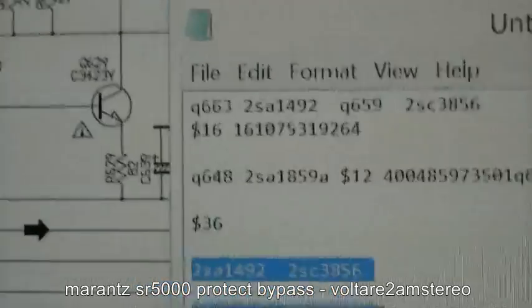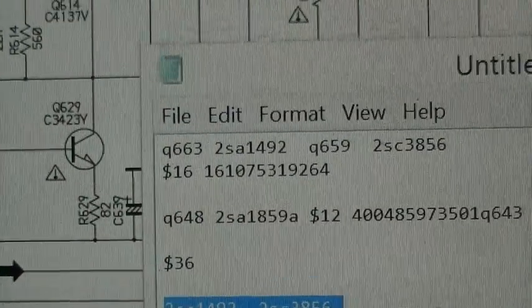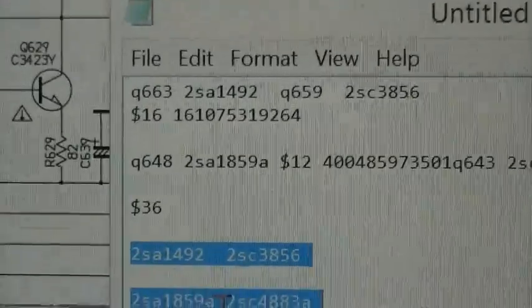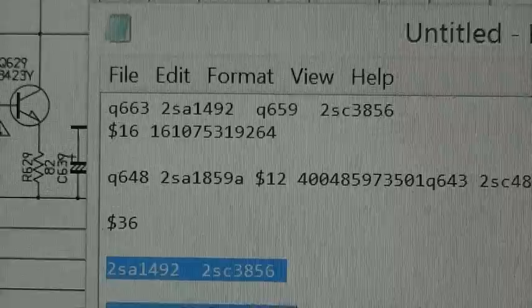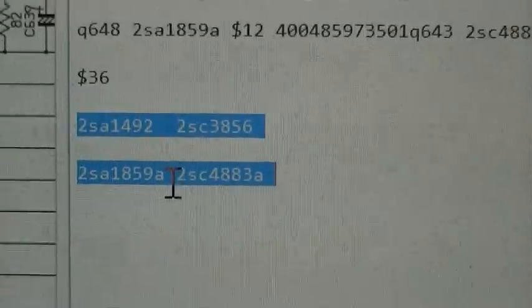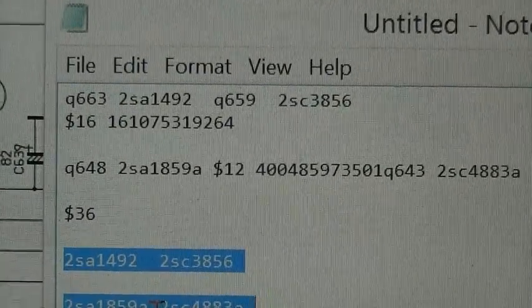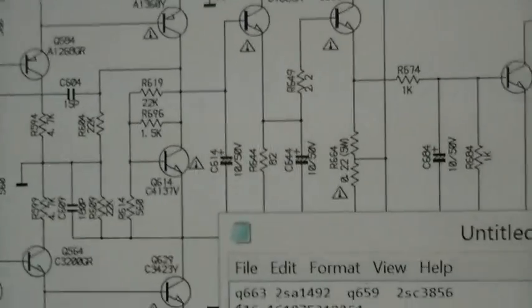Problem is, you're looking at about $36 to replace all 4, and then it'll be back up and running hopefully. Plus the 2 burnt transistors, 2 burnt resistors as well. They'll need to be changed because they're gone. But they're 0.22 ohm at a quarter watt or a half watt. So I'll just get another pack of those. That'll add $1 to the total. So $37 and a bit of research. We're good to go pretty much.